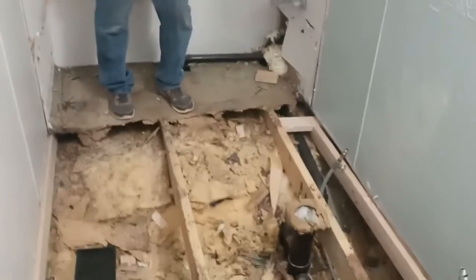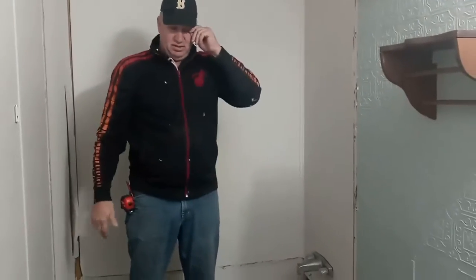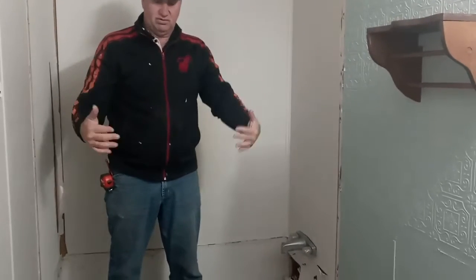The next thing, we don't go with the floor running with the floor joist, because invariably it ends up getting dips in between, because plywood strength is across it. So we're going to run across the floor to get that strength. And then if you notice, we've got 2x4s on the edge over there, and it's screwed.